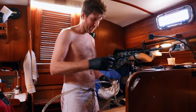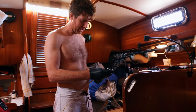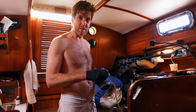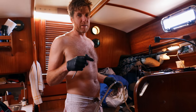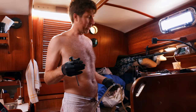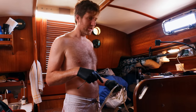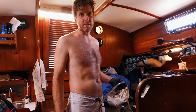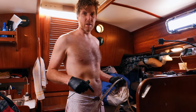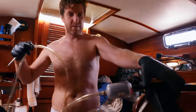They say it doesn't have to be a perfect ratio, so I'm not that worried about it. We are cleaning our fuel because it has a bunch of nasty sludge in the bottom. We've had really good luck with our fuel tank the last few years until it leaked. We decided this year that we were going to pump it all out so that if it did leak, there would only be the tiniest little bit in the bottom. But I think what happened is that all of that air and the condensation and the heat and cool changes in the summer while the boat was in storage just allowed an environment for the black diesel sludge to grow in the tank. So we're going to try this fuel additive. I've got my fuel polisher. We've already run the fuel polisher for quite a while and you can see there's already a bunch of sludge in this fuel filter — so we're doing something. It's working.